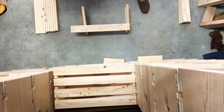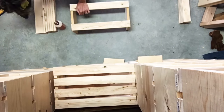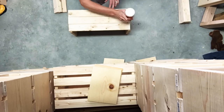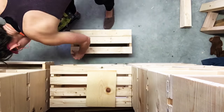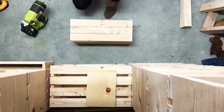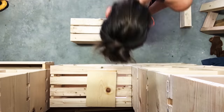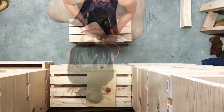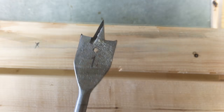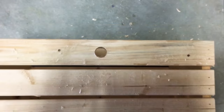Next, I'm on to making drawers for the two bottom rows of wood crates. These simple drawers are made up of three pieces: 1x8s for the ends, and 1x3s and 1x4s for the slats. Same as before, I'm using wood glue and 1-1/4-inch nails and my nailer. The strategy I use to ensure things remain even is to attach the top slat first, then the bottom slat, and then eyeball what's in the middle. Quick dry fit to make sure it fits. Now I'm on to making a pull for the drawers — marking the middle, I'm using a 1-inch spade bit to drill a hole about 1-1/4-inch down from the top. Now we have a pull, and we have five more drawers to go.